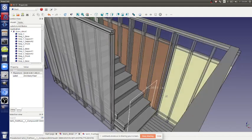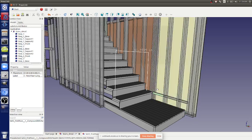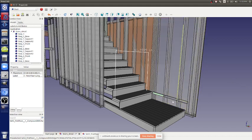And it should actually end up on these little blockings, which we did in the last version. All right, and then electrical is underneath. Yep. So what's the difference from the current model? We don't have that blocking because we're going to use battens and just fix the plywood to battens. So we don't have to worry about blocking at this level.